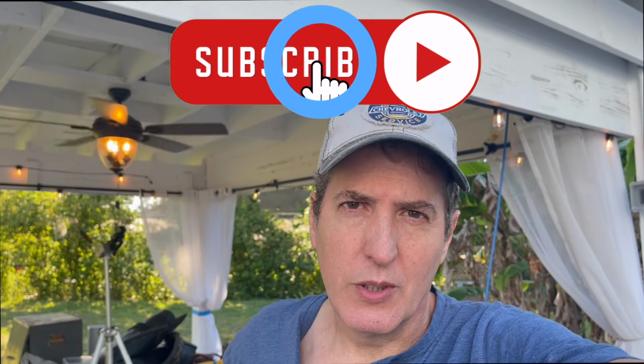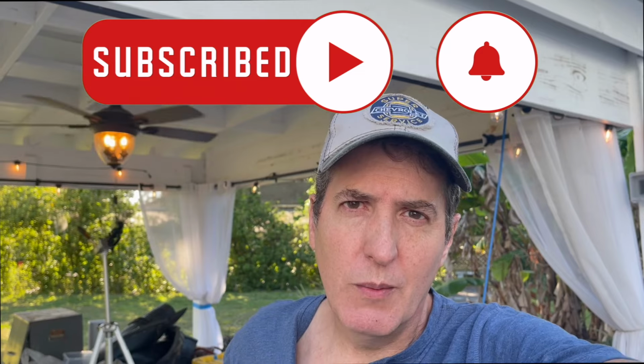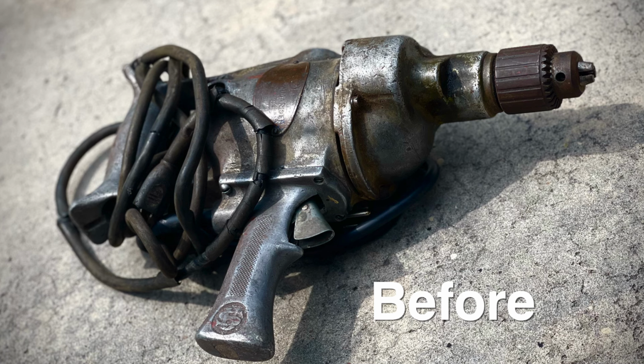I mean, Bakelite did exist, and I forget what Westinghouse had. They had a certain type of plastic that was cotton fibers, but probably wouldn't have been used for that. So I should have known that switch was actually not the original. And there were other clues, like the wiring had been redone at some point. But hey, I did what the previous people should have done. I filed the inside out a little bit to accommodate the switch, and it made the wiring a little bit safer. And we were able to seal that split in the handle with JB Weld.